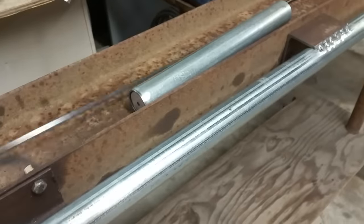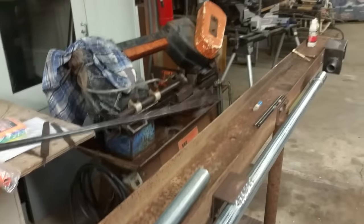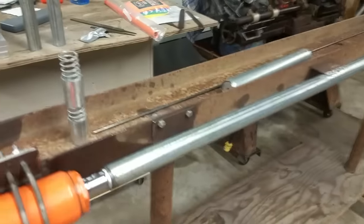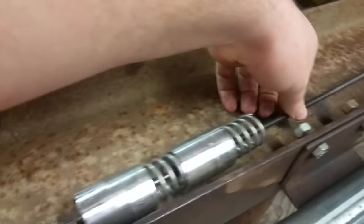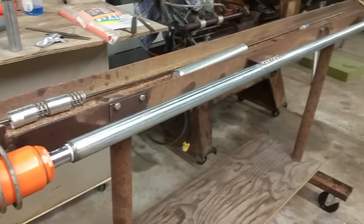The pushrod — here's an example — this is a quarter-inch pushrod made out of 1144 steel. You can see how wobbly it is when it's not supported. So if you're going to have eight tons of pressure behind that pushrod, you need to have it supported. That pushrod just sits right inside those bushings. I have about 22 of those bushings inside this pipe.